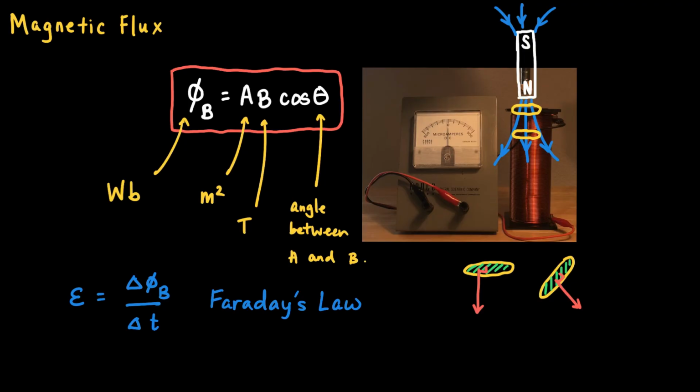You should have also observed at the beginning that when I push the magnets into the solenoid, the current spikes in one direction, and when I pull the magnets out of the solenoid, it spikes in the other direction. But when I flipped the magnets upside down, then the current spiked in the opposite direction that it was originally. And the idea of magnetic flux in Faraday's law helps us understand that maybe there's something going on with the polarity of the EMF produced inside of the conducting wire, but it's not enough to fully explain what's happening. And so in the next video, I'm going to introduce a new law, Lenz's law, that will help us understand what's going on with the flipping of the direction of the EMF with the flipping of the magnet.